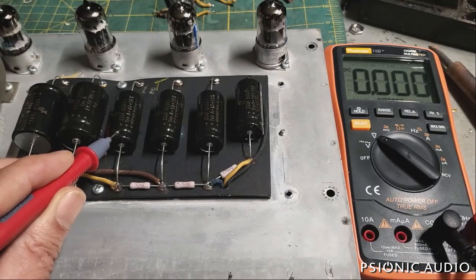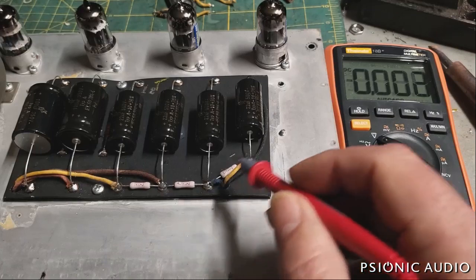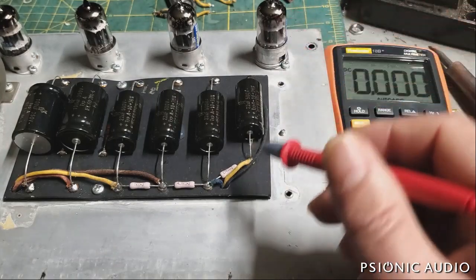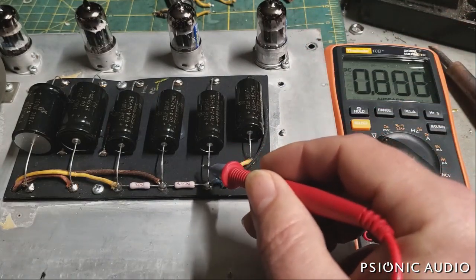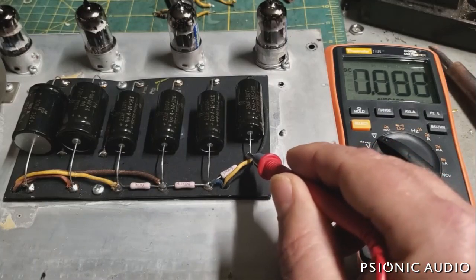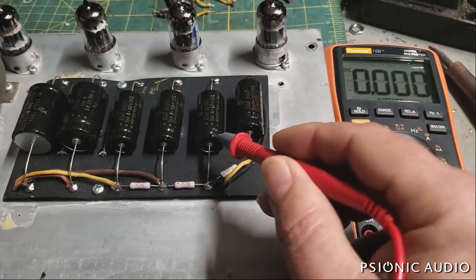You have to make sure that this capacitor is rated for that max voltage. These later preamp nodes will have much lower DC levels because as the tubes draw current through these resistors, the voltage drops. At initial power-on there's no current, so the DC will be artificially high. Some amps might have 350-volt caps here where I have 500 — that can be a problem.